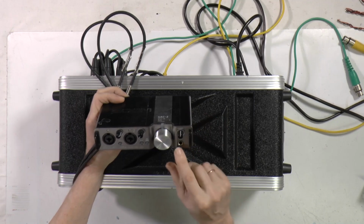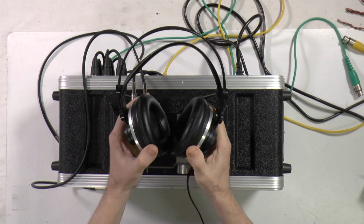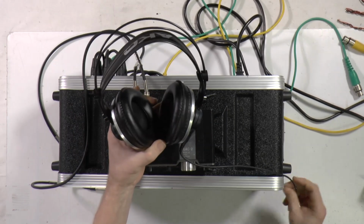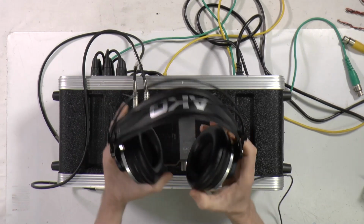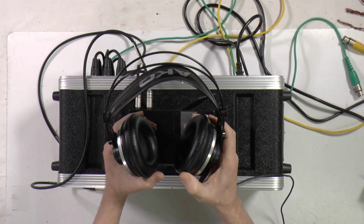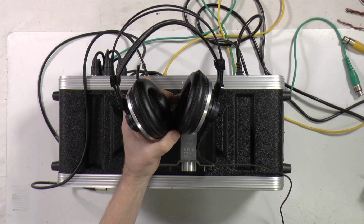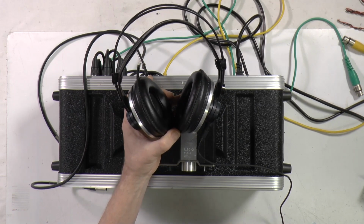And then there is another amplifier inside for good headphones. What is important about good headphones? Those are closed type headphones, and they fully insulate you from the room. And when you do all the tunings, why is it so difficult? Because you have a huge room influence. And when you listen on headphones, there is no room influence. The music sounds exactly how it should be. And when you do the tuning, you compare it with the headphones. And this will allow you to get a far better sounding balance than with measurements, if you don't know how to properly measure and what kind of signals we should use, also to handle this room influence.